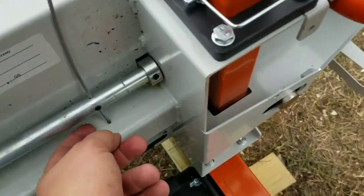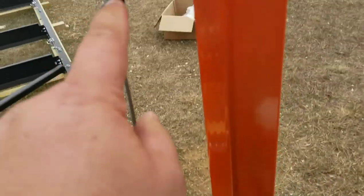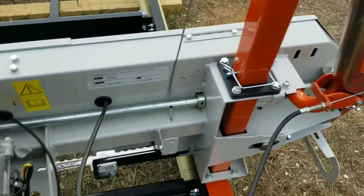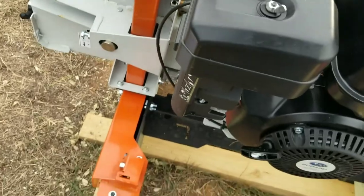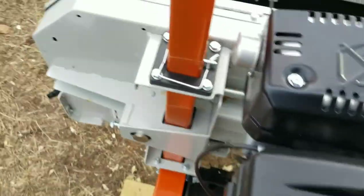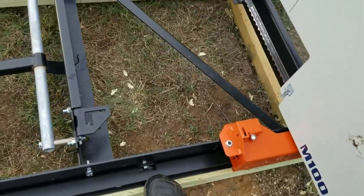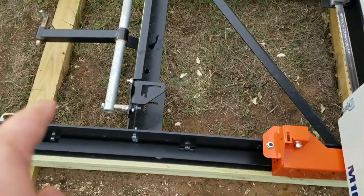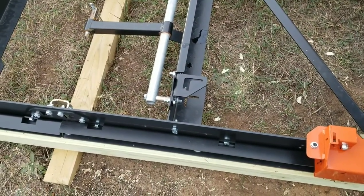Get the lift cable tightened, cinched down. Adjust it to make the blade and the saw head parallel to the frame, to the log bed. Get the height stick on. What are these rails called again here? Catch rails. These catch rails are almost done. All the squaring post sockets are all squared up as best as we can without having precision instruments.